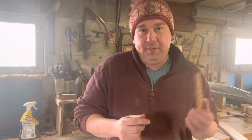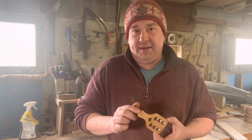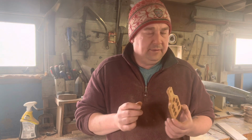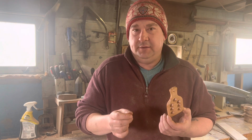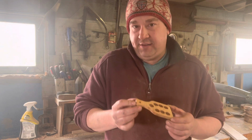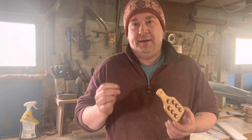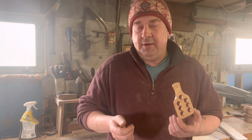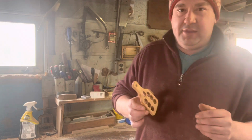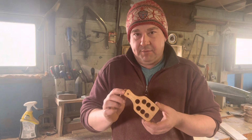You know, I built some for 50 cal, and I cut the holes with a 1/2 inch because 50 cal is a 1/2 inch bore. And you can probably get away with doing like a 17/32 for a 54 cal, or like a 19/32 for a 58, or a 15/32 for, say, a 44. These are all loose numbers, and you can thin them out a little bit to make sure your balls will fit. But I'm pretty happy with this.